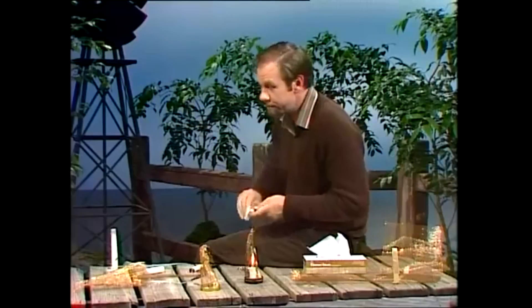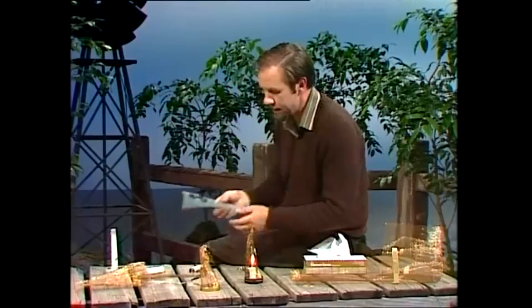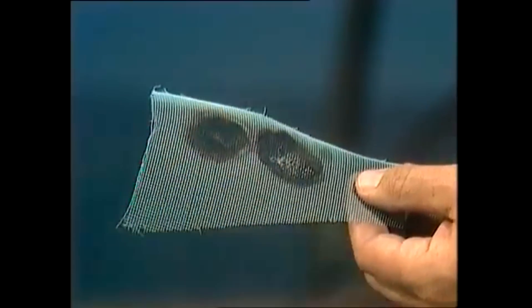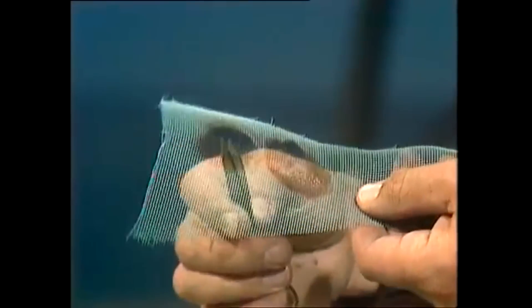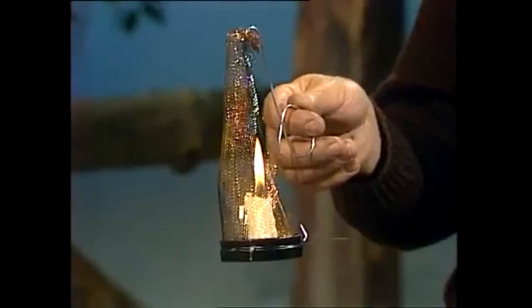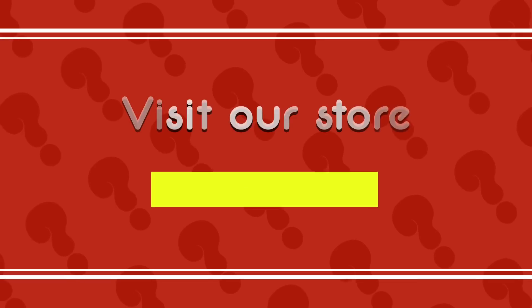Well, why don't you use aluminium? For the very good reason that aluminium goes to oxide. And when it goes to oxide, it does let the flame through, or it can. And of course, the oxide is very brittle, and you can poke holes in it, which means that it doesn't really act as gauze any further. So you go for bronze gauze — if you can get an off-cut, make it into a cone — and you can make yourself a very safe little camping candle cover.